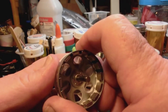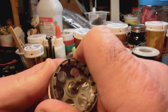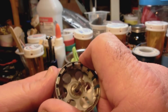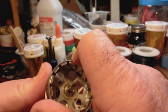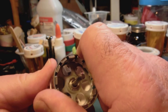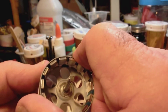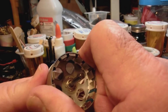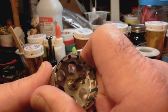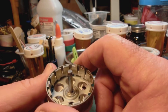what you can see, this is what's going on, is that this whole thing, which is the prop shaft, which is swedged inside the can there, loses its grip and it spins inside the can, you see, and so you can't get the propeller off. And when that happens, well, you're stuck. You got to take the motor out and replace the motor.